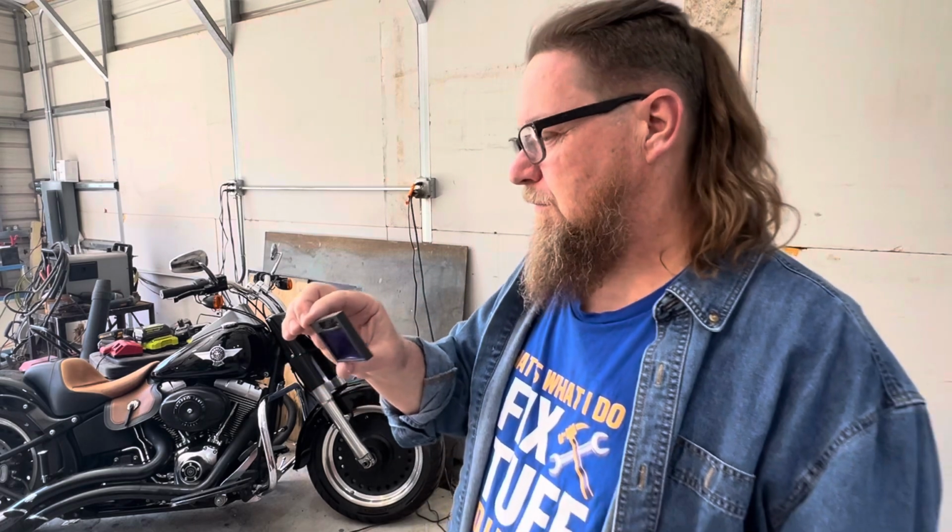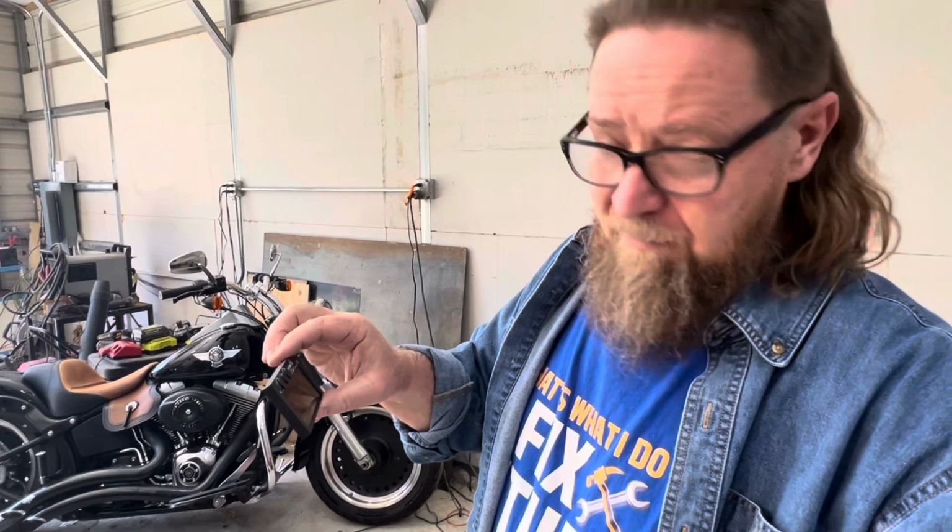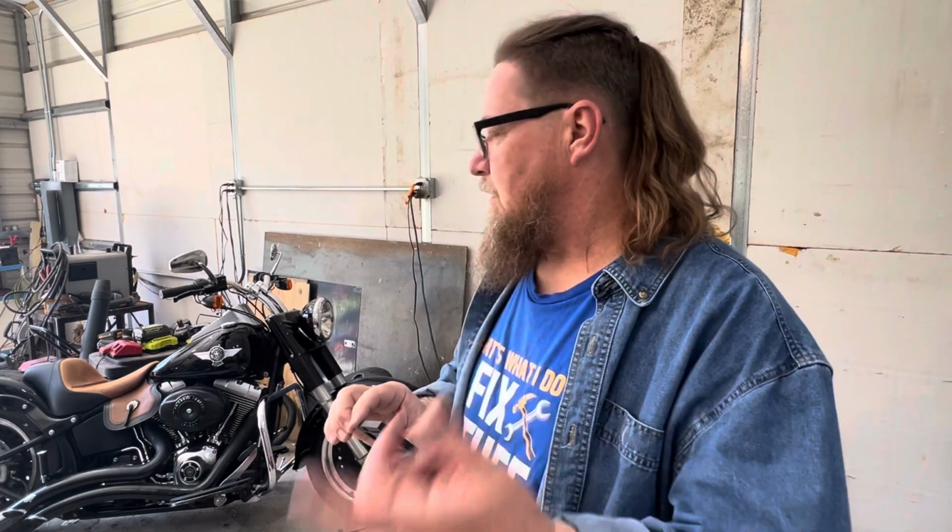A good dark set of safety glasses, level 8 or 9, is good for plasma cutter. But for welding, it's really bright. So, depending on the intensity of your welder and the heat range you're running, you want one that can go up higher. Somewhere between 10 and 11 is normal for like your MIG welding and stuff like that.